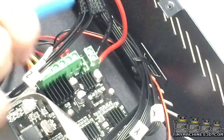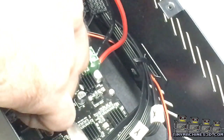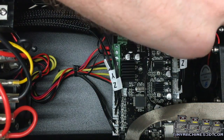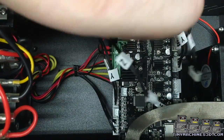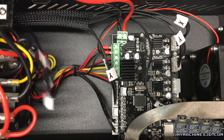After opening the control box, you need to clip two zip ties — that's going to allow you to remove the cables after you disconnect them from the motherboard. Find the stepper connector labeled Z and remove it, then the end stop labeled Z and remove it. You can now pull them through the rear of the control box.